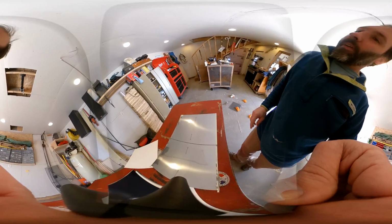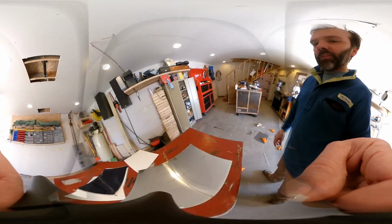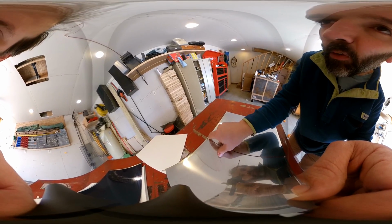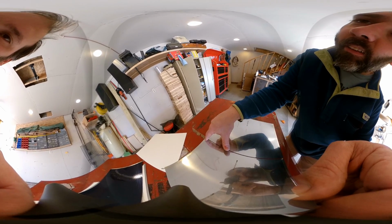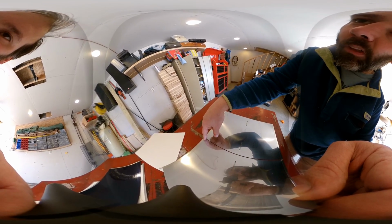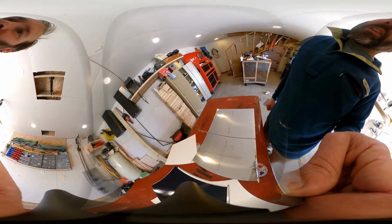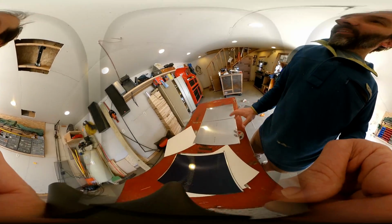And then you put some flux down here and here. When I'm soldering this, I lay a piece of solder underneath between it, push this down on the soldering iron and sandwich it, solder it together, hold it down with something cool, bam, it's done. Then I repeat that process. It's pretty quick and doesn't take very much solder. Having said that, let's go look at the construction of the solar panels that we made.